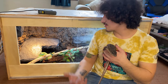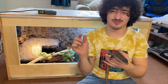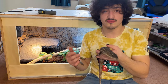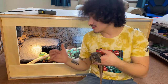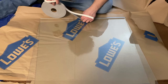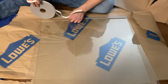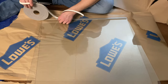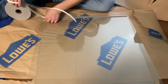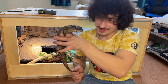Last up was adding the glass. We went with regular glass — we couldn't find quarter-inch acrylic in a quick enough timeframe. The track here is a half-inch, and quarter-inch acrylic for this size would have been about 75 bucks, which I didn't want to pay. So we got standard replacement glass, but we ran foam tape on the top and the bottom of the back piece so they're not clanking against each other. That foam takes up the wasted space, making the doors more snug with less play.